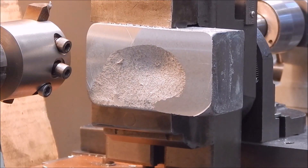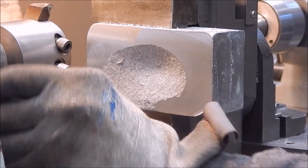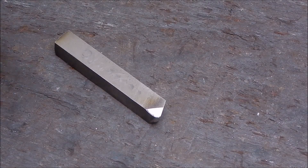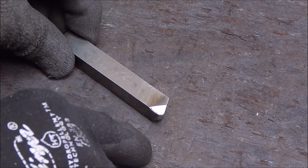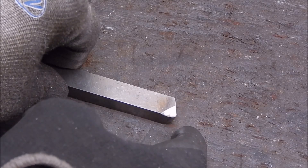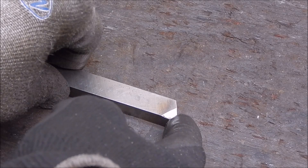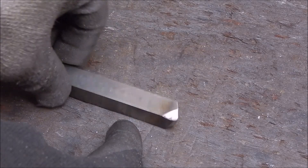How's that? That once again is just great — that's like a mirror, that's like this one. And there wasn't any galling on the cutter at all. So here's the cutter you want to use: high-speed steel square section, got a concave leading edge or face as you can see — just a little concave — got some back relief, and it's got a good wide radius tip on it. The sharper the tip you have, you'll find the poorer the finish generally on aluminium. To get into corners it's nice to have a sharp point, but you can always do that on a final pass. That's the one you want — that's what gave the beautiful finish.